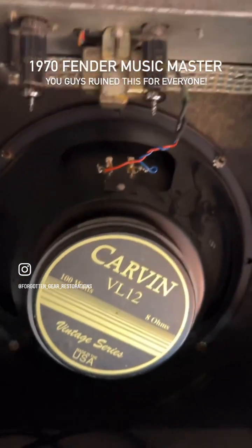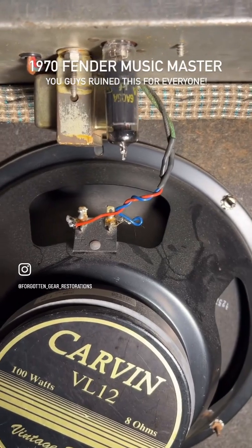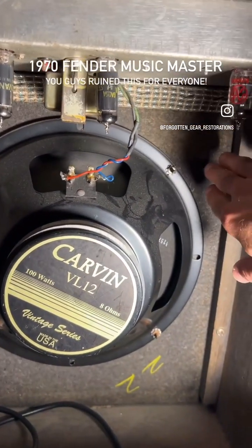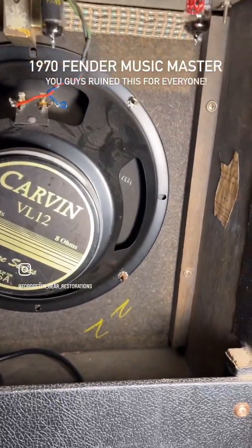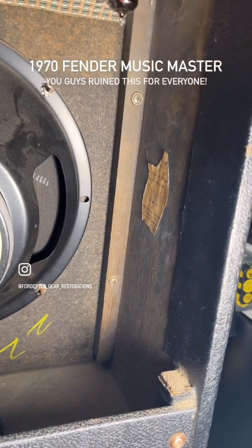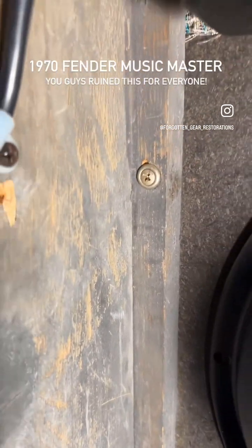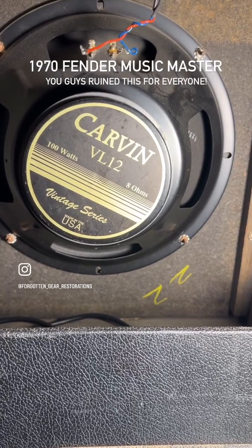Old Sylvania stock 6AQ5s. And one 12AX7 preamp tube with a solid-state rectifier. You can kind of see some of the old silver-face heritage in the baffle — the speaker baffle — which looks like it's particle board. But this amp was early enough where it has some of the blackface construction cues. So this is probably one of the more desirable ones you can get. Absolutely love these.